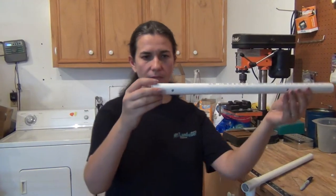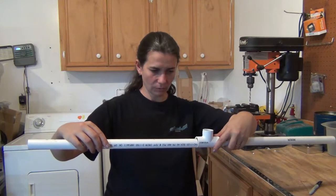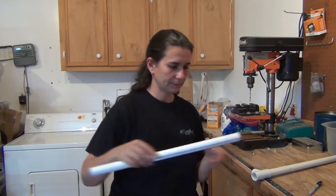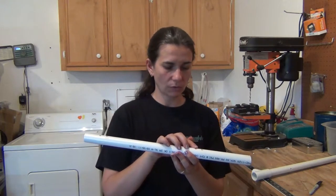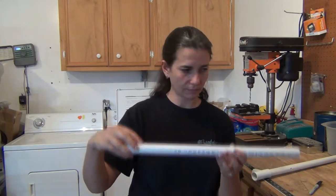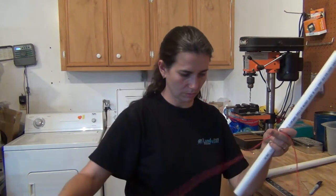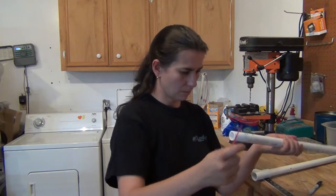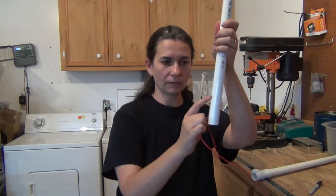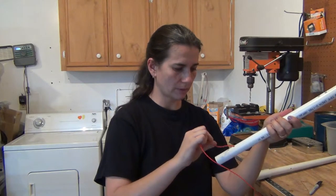As a result, you see one straight hole through the pipe — those eventually go together like that. But you need to have wires in here. We use black wires for the M and N electrodes — the inside electrodes. The outside electrodes have a red wire. We're going to take a piece of wire and put it through the side opening, through the pipe, just on one side of the pipe.